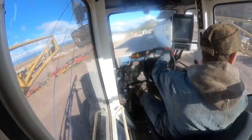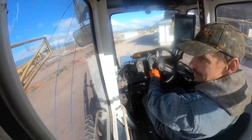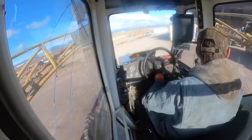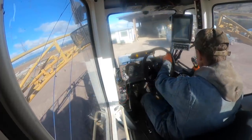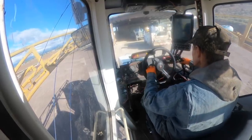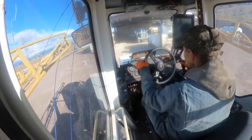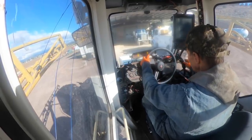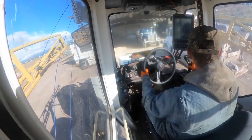Like it's that right front motor or torque hub or something going on, but you would think if a torque hub was bad, it would do it in forward or reverse. It wouldn't make any difference direction of travel. Man, it sure labors going forward. Sometimes you can pull the motors out of the torque hub and just spin them and see if one stops. You might have a motor that's got a directional problem.